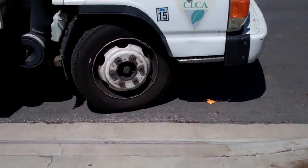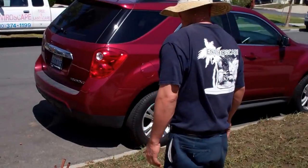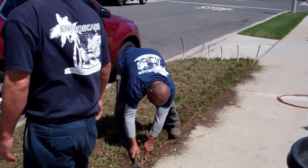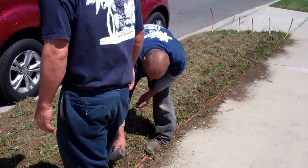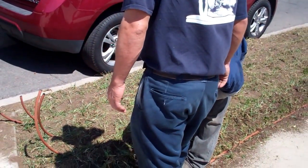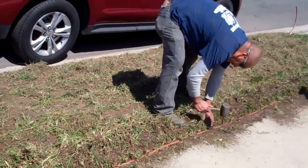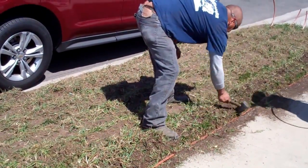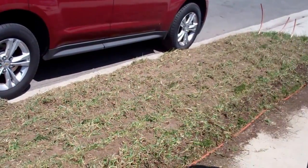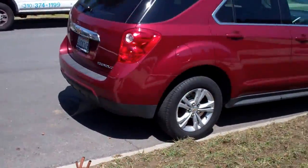All the trenching is now complete — it didn't take too long. If you notice the gentleman behind me, they're installing the staples that hold the drip tubing in place until it's time to backfill. Those are iron galvanized staples holding down our Rainbird copper shield technology drip tubing. Part of the drip process is having all your calculations correct. Right there we're at four and a half feet — it's better to keep your spacing tight rather than too far apart. They depend on the capillary action of the soil to move water side to side, so we went ahead and installed an extra row there.